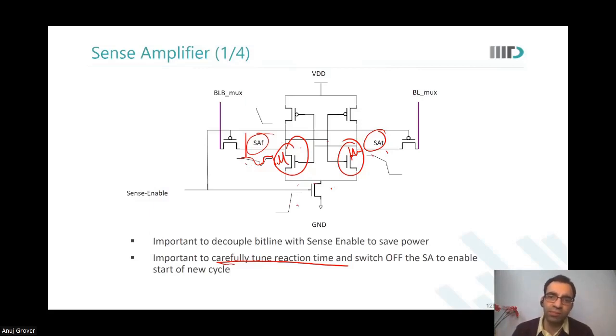Is there some data stored inside the sense amplifier that we are trying to read? What is happening? No, sir. We are not storing any data. Is there a stability condition around the sense amplifier? No, sir. Then, see, the structure looks very similar to a 6T SRAM cell, but don't get confused. It's still a sense amplifier. It has a completely different functionality. To design it, you need to consider the functionality that is required of it in your analysis, not how it appears to look.